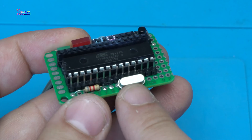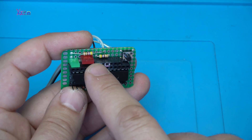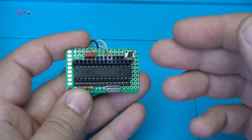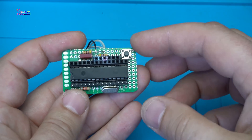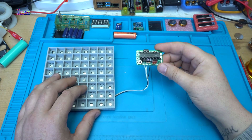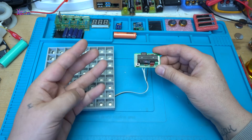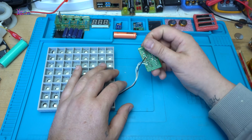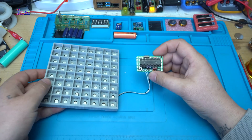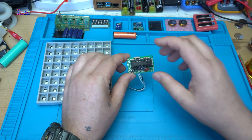The circuit uses the ATmega328 chip, a 16 MHz oscillator, two LEDs — one for power on and a second LED soldered on digital pin 13 — and one push button. I've already programmed the code into the chip. From the Arduino board to the NeoPixel matrix, only 3 wires are needed: positive, negative, and one wire for controlling all 64 LEDs. They are addressable and each one can be individually programmed and controlled by the Arduino board.